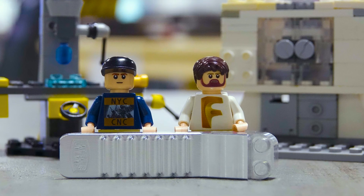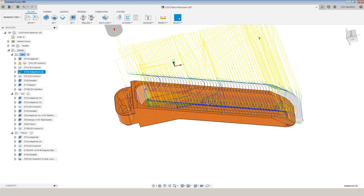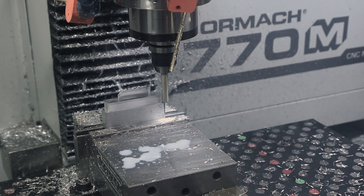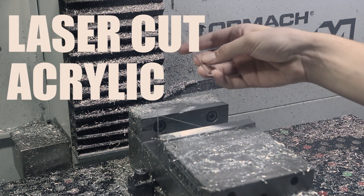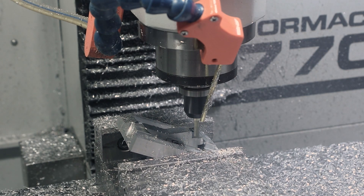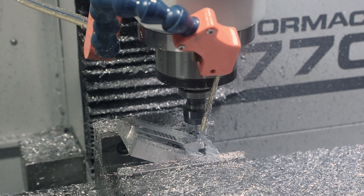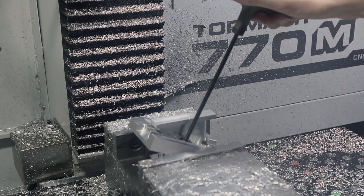Next up — who doesn't love Lego? We wanted to make one of the brick removal tools as an educational video on CAD/CAM and fixturing. In Op 1 we held the stock in a Tormach 5-inch vise with parallels to raise the material up, and machined the majority of the part away. For Op 2 we used a vise plus a custom machined fixture along with an angle jig to hold that custom fixture at the right location. This was the best CAM workflow to complete the part in two operations, and also a good approach for higher-quantity production. The key takeaway: don't forget about the ability to use fixtures inside of a vise.